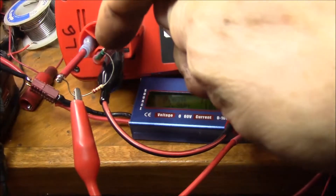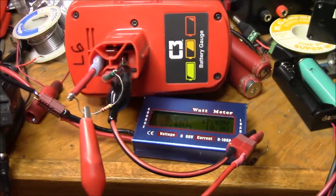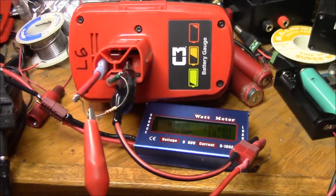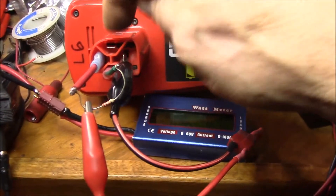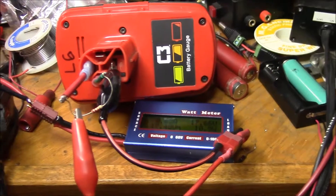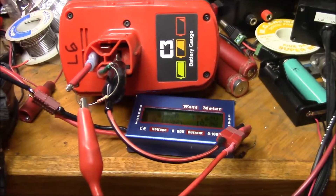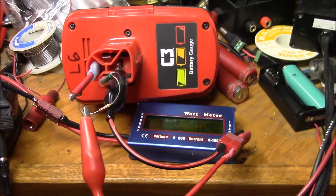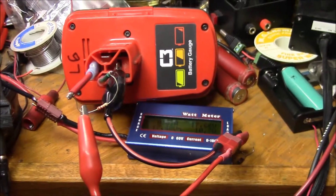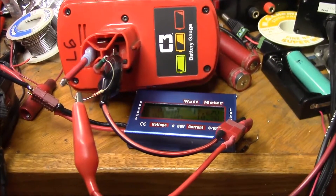Playing around with this, I found my little pull-up resistor trick on the left side terminal seems to do the trick on this battery pack. I tried the right side terminal and it shut off again. So the trick in this battery is a little pull-up resistor to the positive terminal, and then there's the built-in pull-down resistor to the negative terminal. That's been going on for a while here.